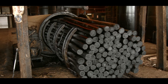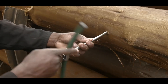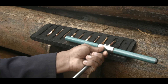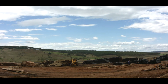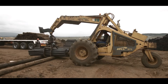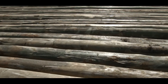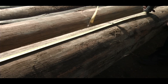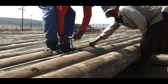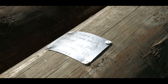The trolley with the pressure treated timber is pushed out to the storage area. For every charge, 13 samples will be selected to test and ensure that the correct penetration of chemicals is achieved. Retention is also verified on all poles in the charge. Once both checks have complied with the strict requirements, the timber will undergo what is referred to as the 100% inspection. During the 100% inspection, the timber will be rolled out onto runners so that every pole can be inspected individually. The timber is graded and inspected according to precise customer requirements, and penetration of the preservative chemicals is checked on every pole. At this stage, the identification tags are placed on the poles. The timber is now ready to be dispatched.